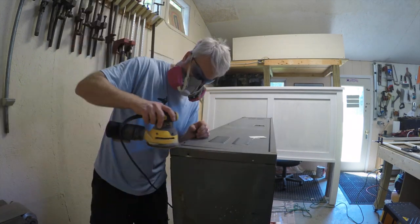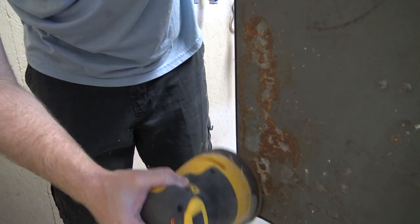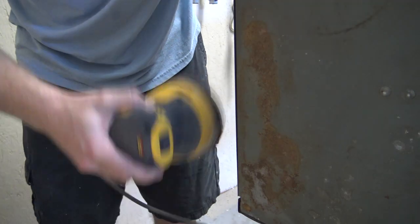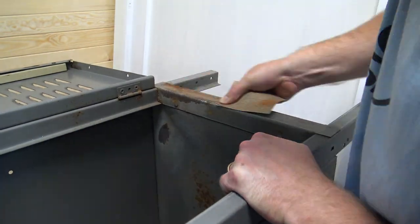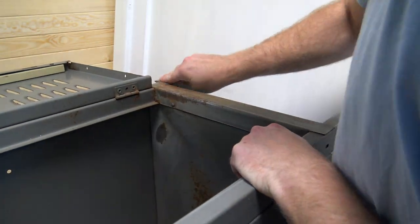I think this entire sequence took about 30 minutes of just trying to fix the parts that were needed. This is the worst part right here. A couple minutes and it's pretty clean. I went over the inside too, just to make sure everything was smooth and rust free. And then stuff I couldn't reach with the orbital sander, I just went over with a piece of 80 grit sandpaper.